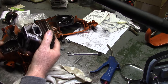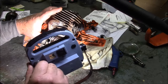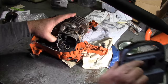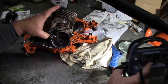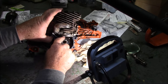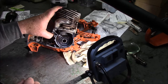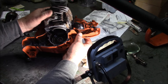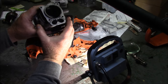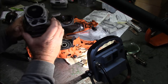Looking for places to hop up a little bit, and in particular always looking at the bottom of the transfers. There really isn't much you can do with that on this saw. The other thing I always look at is the bottom of the flange and how far away from the case it is for no base gasket builds. I've got no base gasket in there and there's easily 40 thousandths clearance, so the no base gasket build concept probably works just fine. I'm a little hesitant to take a lot off the base of the cylinder, so to drop the cylinder without risking the integrity of the casting — therefore a sealing surface — I think removal of the base gasket is actually the better approach.